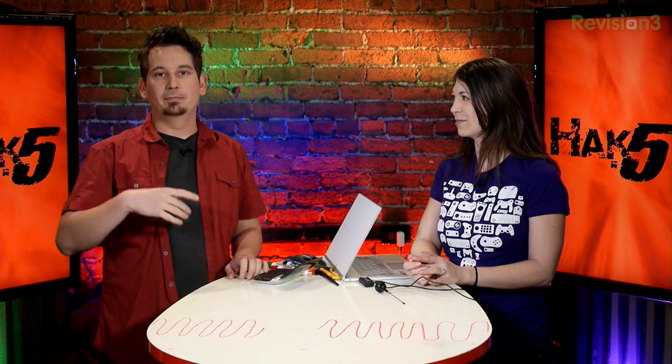But anyway, we've been talking about radio, and so we're going to get into a little bit more theory stuff because it's really fun. Last week we talked about spectrum, in terms of radio frequencies. We know that, for instance, Wi-Fi is on 2.4 gigahertz and other fun stuff is on 900 megahertz, and there's cool stuff over in 433 megahertz. I'm still having some troubles picking some of those up with my little teeny tiny antenna over here. Well, this is because this antenna is not made for certain frequencies.